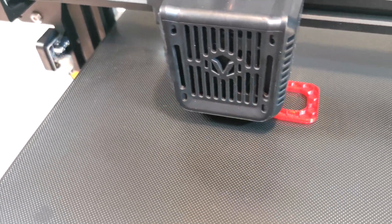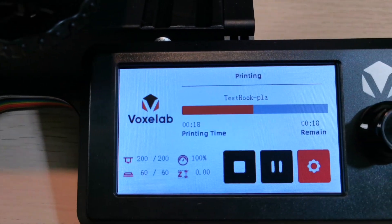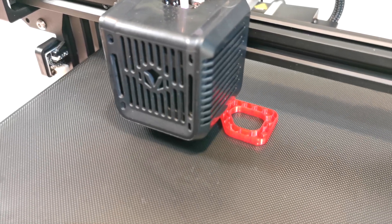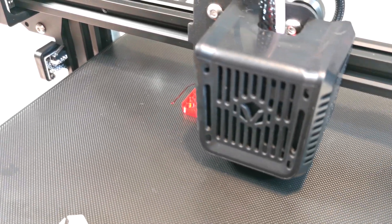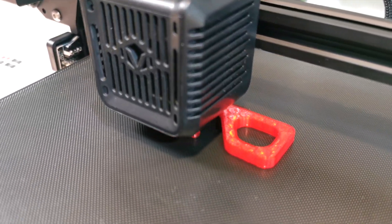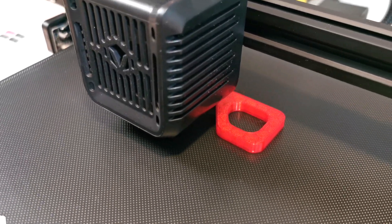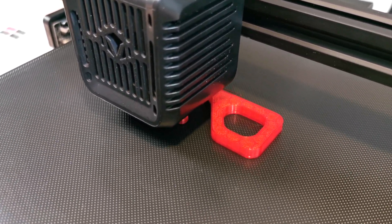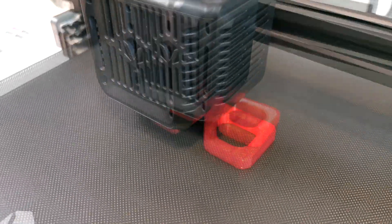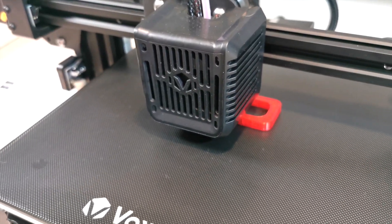As you can see, it's just blitzing through these stages, making the honeycomb center really nicely, and telling you how much time you have left. We've got it set to 200 on the nozzle and 60 on the bed, which is absolutely fine. It's going around, doing the layers, not splitting - just coming out how you want it. We're going to speed up here to the finished piece and leave you to enjoy the first print.